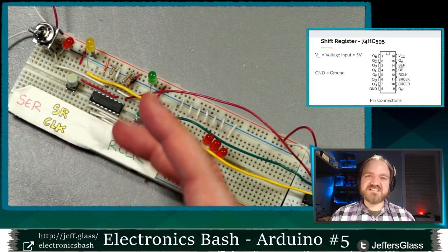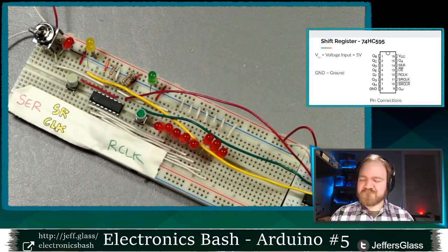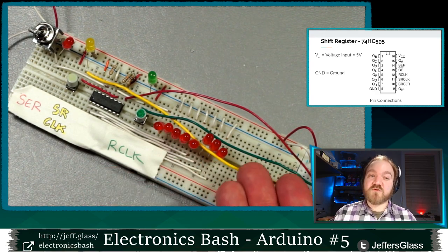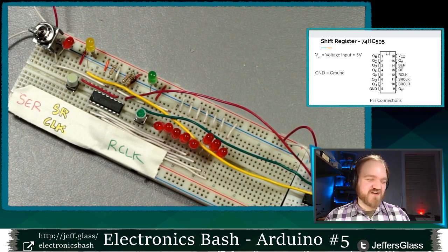Depending on how the circuitry inside these chips works, it's sometimes possible to power them through an input pin. It's not really something you want to do, but there are cases where you can leave that VCC pin disconnected and still see, say, outputs turning on or pins lighting up. You really should just connect your power pin. That's best practice.